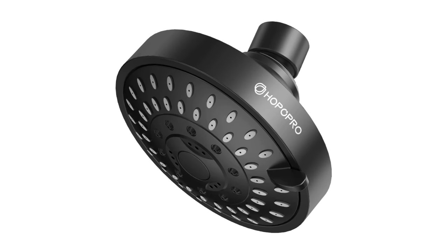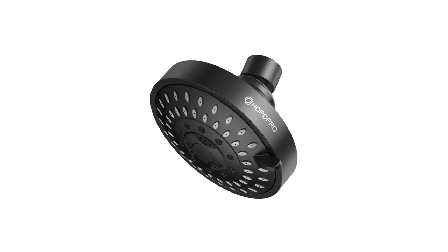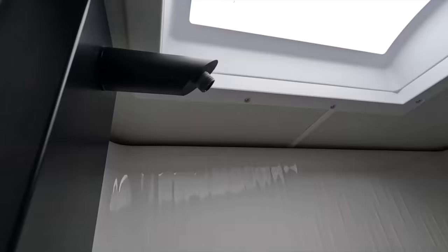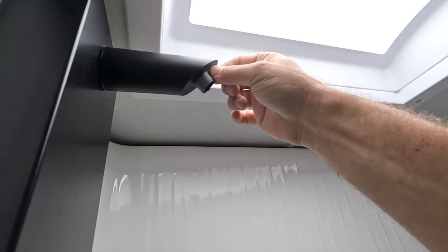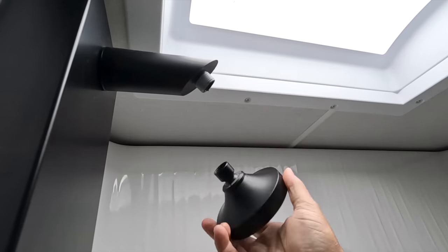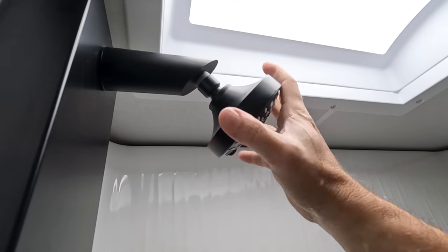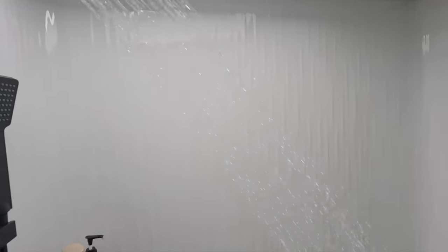But we did find a good replacement on Amazon. It's supposed to be 1.8 gallons per minute, which is a nice reduced flow, but good pressure. You know he's got to do tests. We love our tests. Immediately after installing it, first of all, installing a shower head is super, super easy. You screw the old one off, you screw the new one on. I don't recall if our shower head came with the tape, but it's really easy to pick up some thread tape at Lowe's or whatever. It's real cheap. We could tell immediately that the pressure was a lot better. Now that's a nice stream.